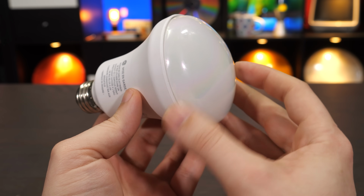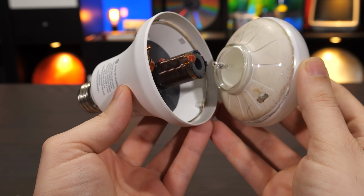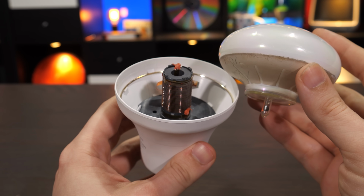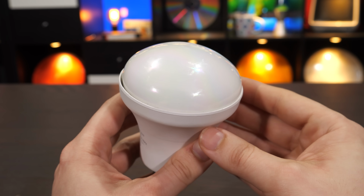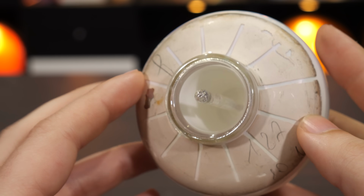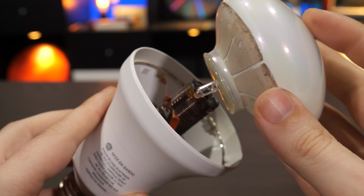Here, the discharge tube isn't so much a tube as it is a vessel. And a single coil, once again in the form of a wire wrapped around a ferrite core, protrudes from the base of the lamp into a hollowed-out section of the glass vessel. This evacuation stem holds the pellet of mercury amalgam, which is required to produce ultraviolet light, and it rests inside the ferrite core when assembled.